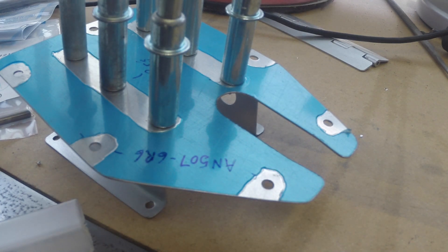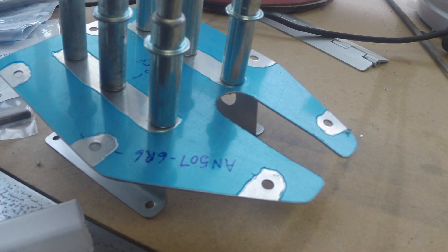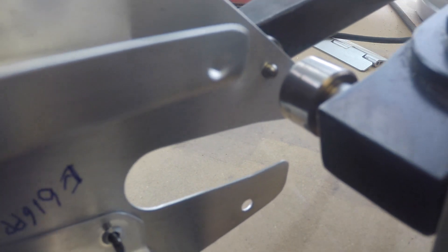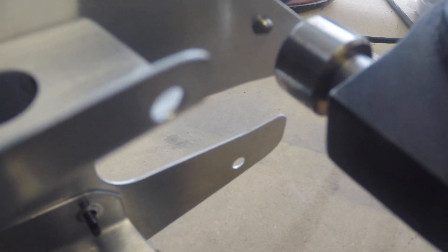I do want to do just a little bit more digging and find out if I have the right size, because there are punch marks on the inside of that hole and they're slightly rough. I would think it would need a final drill of some sort. However, the pilot in the dimple squeezer fits quite nicely — and actually, if anything, there's a little bit of play.